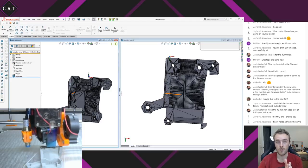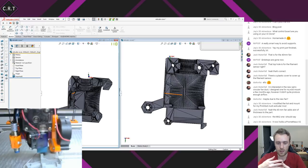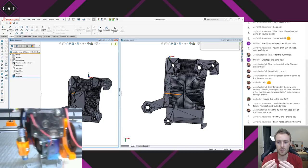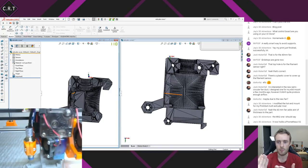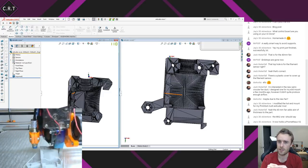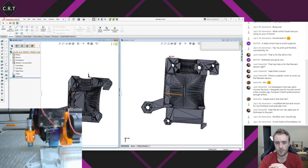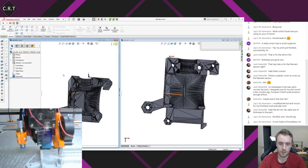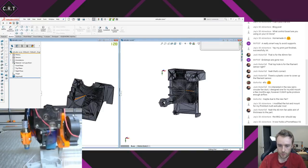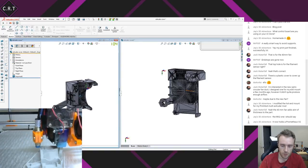In some of the Mk2S parts, they've put basically a plane in and cut the solid body with an infinitely thin wall thickness, which gives the same external geometry but adds exterior walls to the inside, if that makes sense. It does a perimeter that actually butts up against itself, adding strength to specific points within the internal geometry. So yeah, quite a lot of added plastic there, mainly for that 40mm fan.